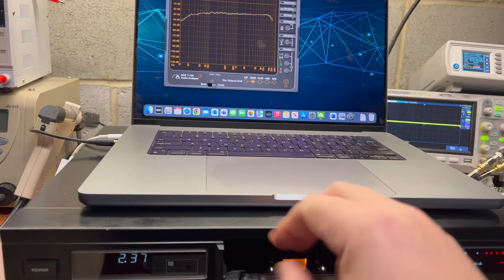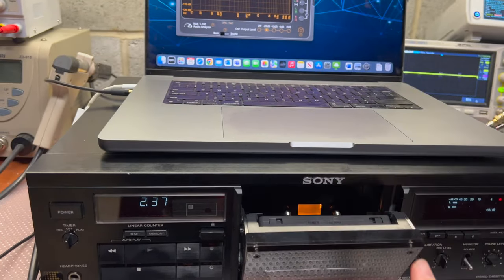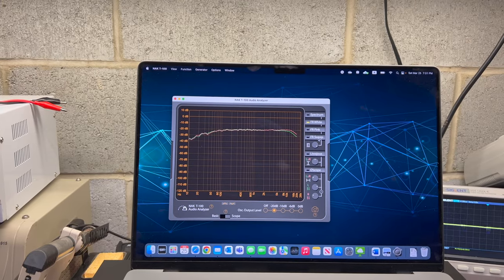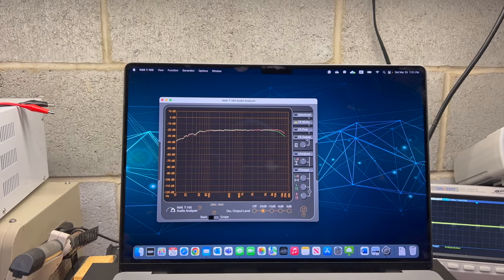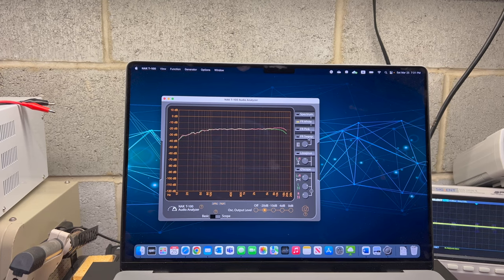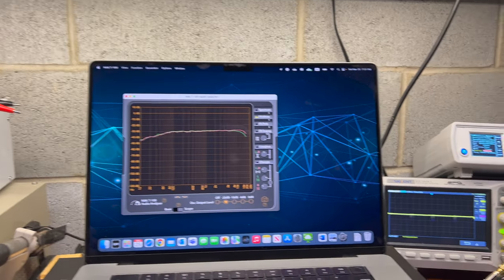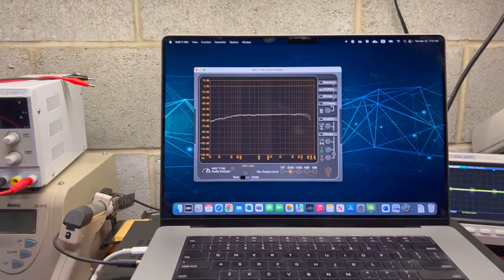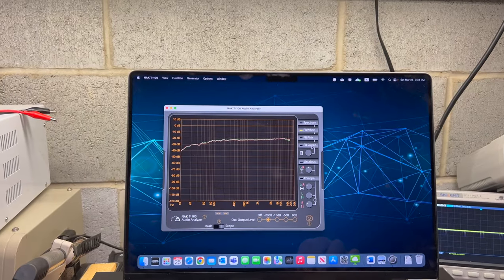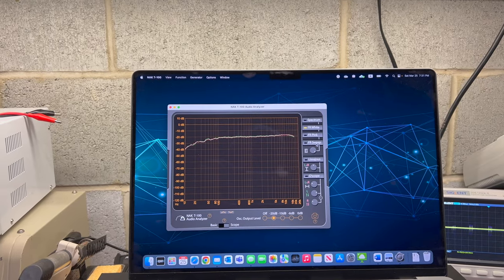Good results. Now, let's see chrome tape. Bias a little bit different between left-right channel. About like 3 decibels. Okay, now metal tape. And metal tape works much better. Maybe my tape is not very good. Here I may even put bias in the middle.